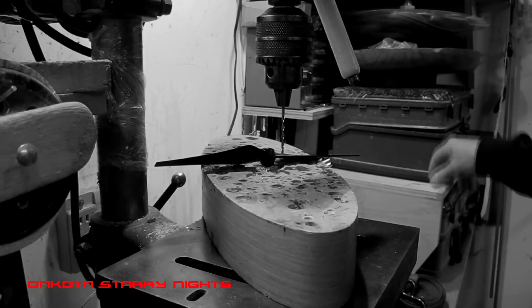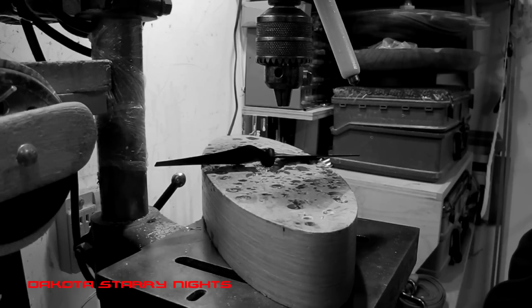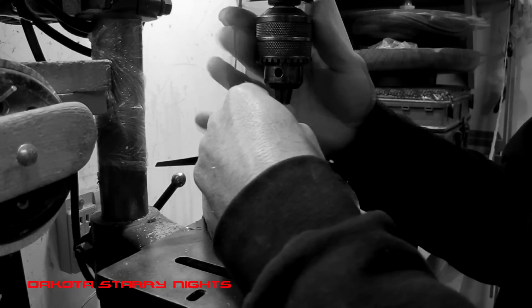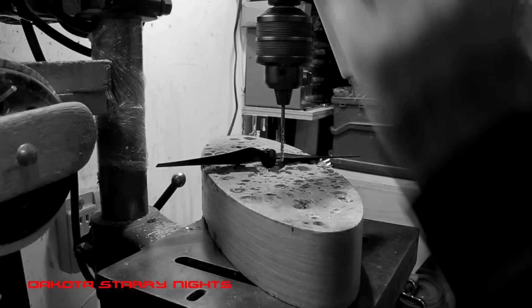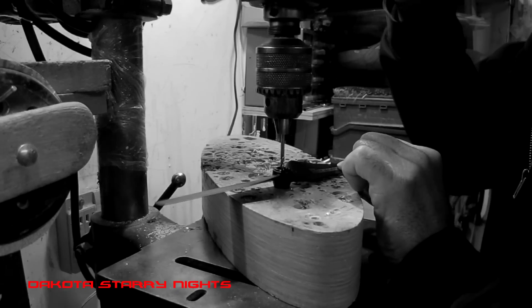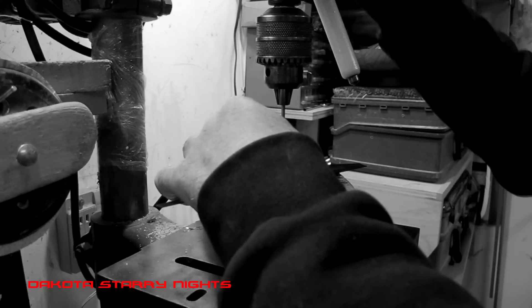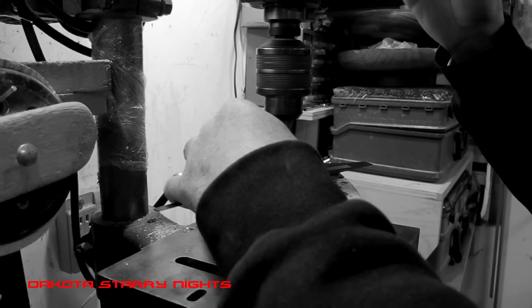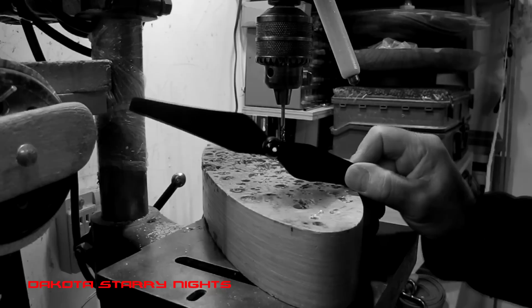If you started out with a 1-inch bit from the get-go, you could wind up being off center. So our next bit will be the actual bit that's going to accommodate the Duo Pro rod, which is a 1-inch bit. Put that in there and give it a little bump to make sure it's spinning center. You want to make sure your drill bits are straight because if they're wobbly, you're going to get a hole that's off. I'll hold it here so you can see — just bump it around so that it finds center. Then hold it with two fingers and slowly drill in there. Let it shift if it needs to. And there it is — that's all there is to it.